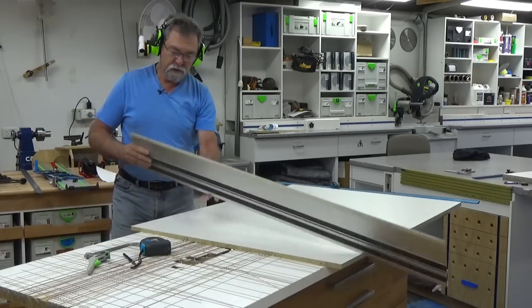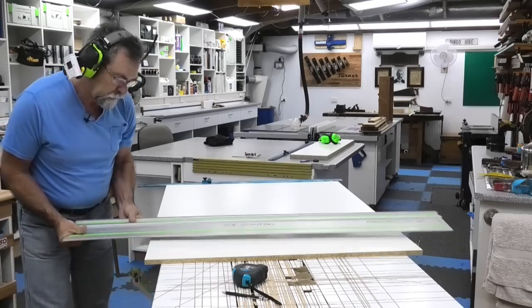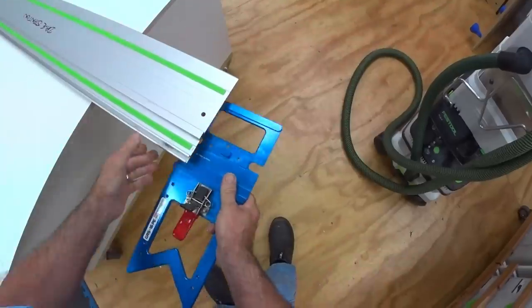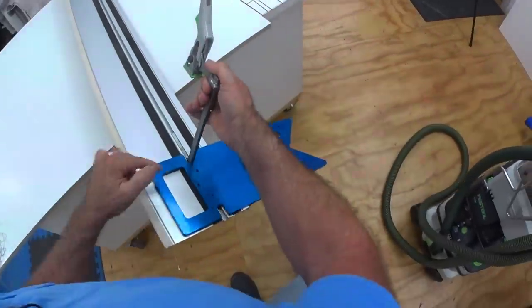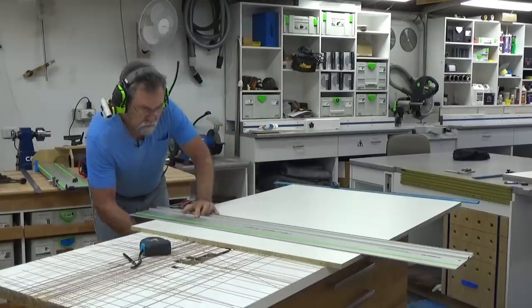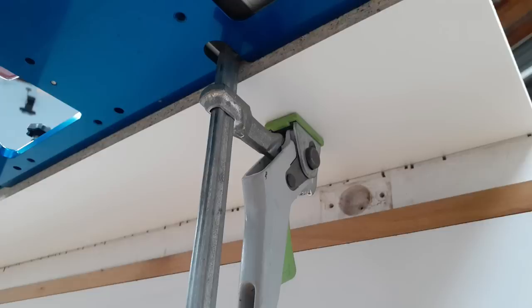To set the guide rail up really well, we put in a lever clamp and use the GRS 16 PE. Pull this little lever back, slide it on, put the clip on, and lock it. You'll notice on the underside there's a gap for it to slide into — it all works really well. Do a little flick, slide that up, lock it, and put a lever clamp over there as well.